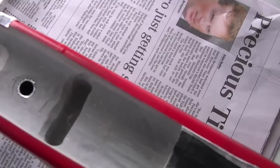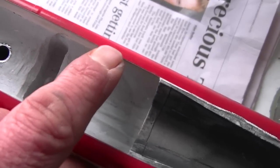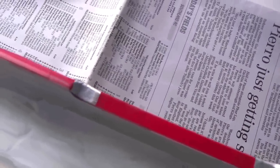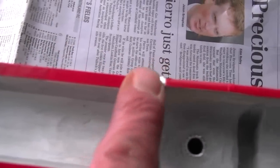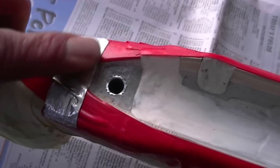Steph's done her electrical taping along the top line of the stock — this is very important, especially for painted stocks. You want to make sure the electrical tape goes to the edge of the stock without going into the stock channel, and without being too far away from it. Steph has left a gap of just a few thou wide, and in doing so she's set herself up for a good finish. Note that at the ejection port the tape tends to try and lift, so she's used electrical tape at each end of the ejection port and down at the tang where the tape also wants to lift. Those are two places to make sure you've got the tape down hard, and then through here she's got that line nice and close, which will result in a good bedding job.